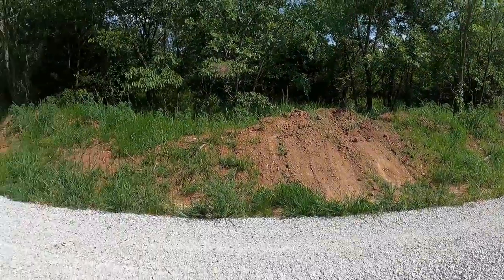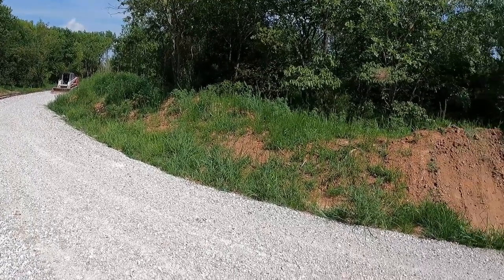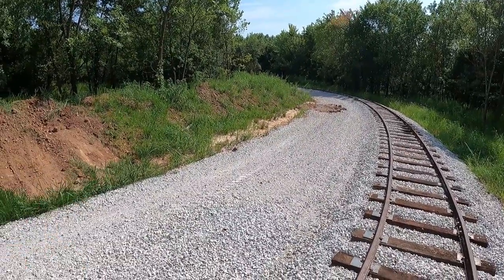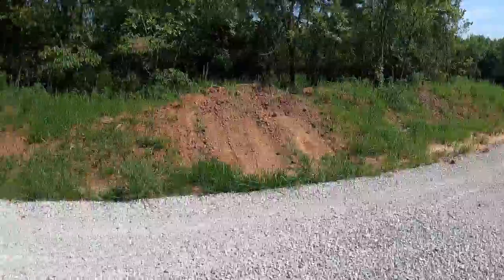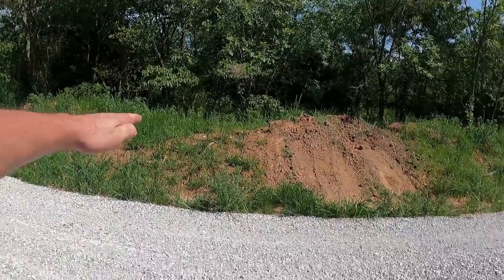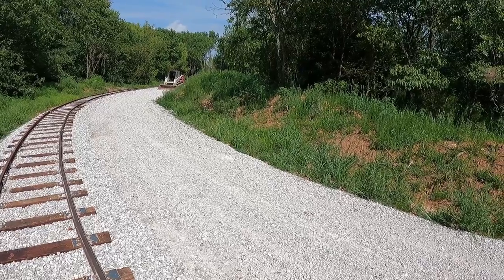What I'm going to attempt to do here, they're kind of just wanting more, it's going to look more like a berm, I guess. They want to be able to come in here and mow it and maintain it a little bit. And you can tell the road on that inside, since there's no fabric, got pretty tracked in or washed out. So what I'm going to attempt to do is just get the loader up on top of there and cut that off. And then I'll shape the sides, because that's probably what we'll be mowing it with, the diamond mower.